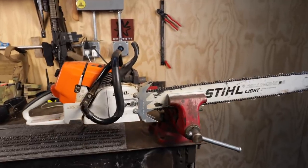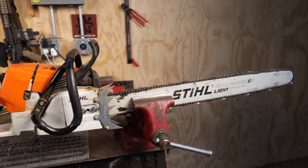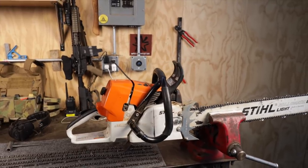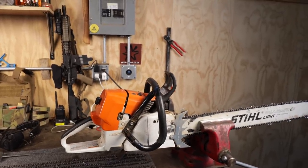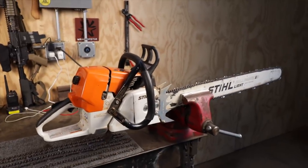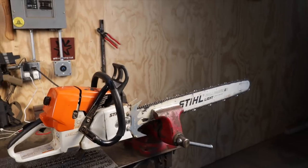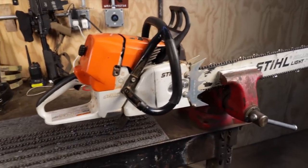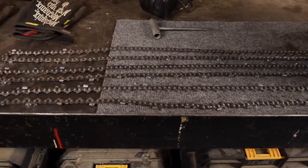The saw we'll be using today is a 461 Stihl with a 32-inch bar. That's about the smallest saw I'd go with an Alaskan. Ideally, a 660. The 660 is pretty hard to beat. If you're gonna do a lot of milling, get a 660. If you want a saw that you can do heavy firewood and milling with, and you're not gonna do a tremendous amount, the 461's pretty good to go. Got four loops sharpened up here, ready to go.